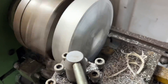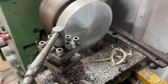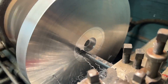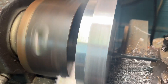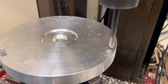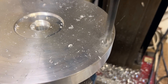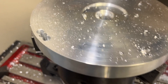Piers and pier construction is all new to me, but I wanted to keep away from the rat's nest design. I don't like the idea of such a strong base and then suspending the mount on some threaded rod, so I decided to create my own custom adapter, which I'm turning here on the lathe. It started out with a 200mm billet of aluminium and I'm essentially replicating the base of my current tripod mount on this new mount.